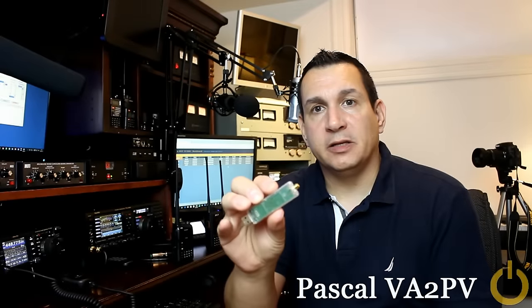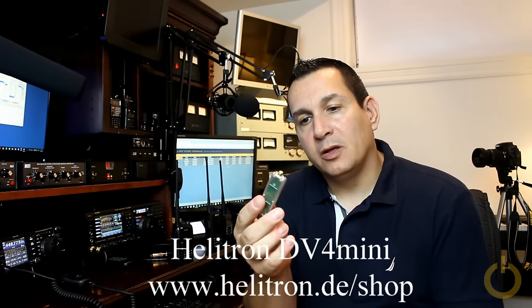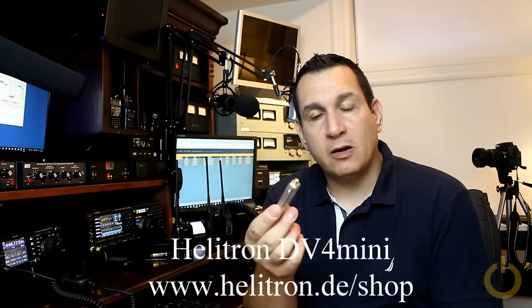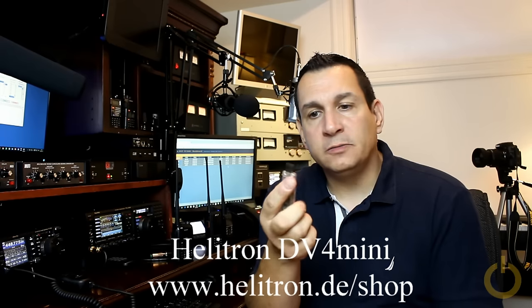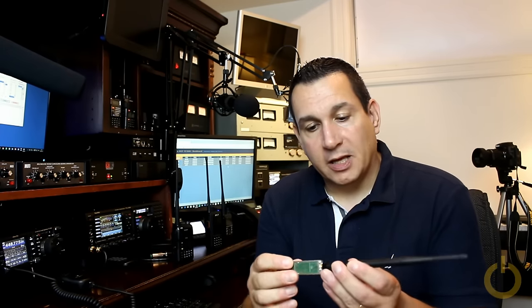Yesterday, I received this little guy, a little USB stick, but it's very particular. It has a UHF transmitter, and it's able to do C4FM, DMR, and D-Star. This is a dongle that I will use to create a point-to-point to IP to get to my repeater. That means I have two of these that I will plug, one on one computer, one on the other, and I will use a simplex frequency to get through the network, through the reflector, and to get back to my repeater on my repeater frequency and get transmitted.